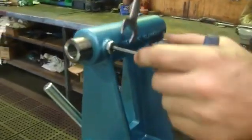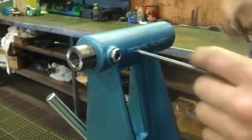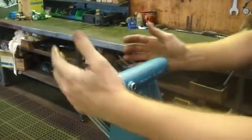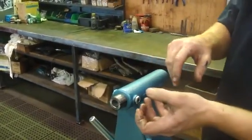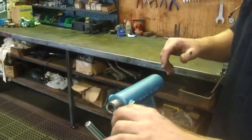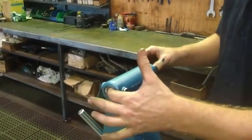I hold, with a 5mm Allen key, I hold the keyway itself in position and tighten it up. Then it's important to check it, because it needs to run smooth. If it doesn't run smooth at this stage, the key might have turned a little bit inside, holding on the keyway. So you'll just have to undo it and try again until it does run free.